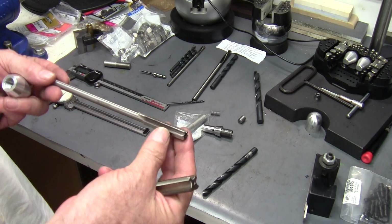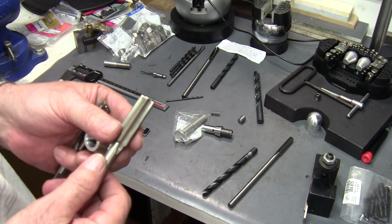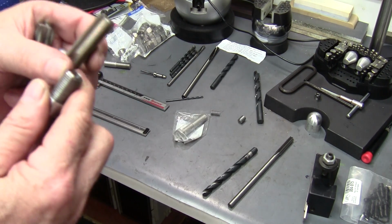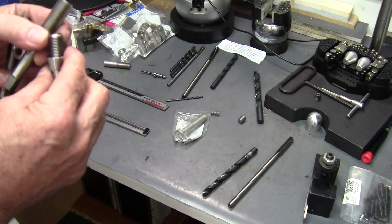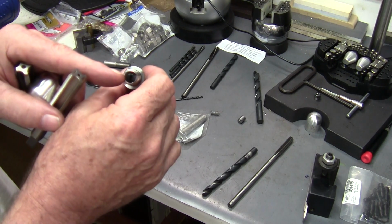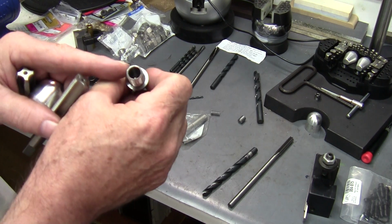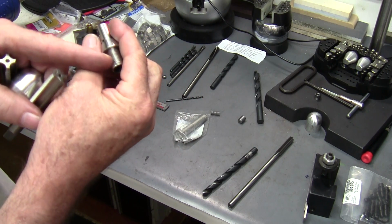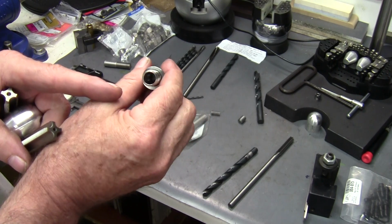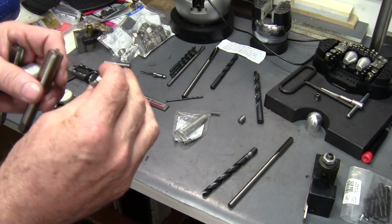you're not going to be able to get away with this .375 reamer. You're going to have to go to .350 because the threads on the 1/2-13 are going to be deeper. And right now, with the half 20 and a 0.375 inside diameter on the cylinder bore here, there's probably a 20 thousandths wall thickness left between the bottom of the threads and the inside of the wall. So it's not a lot, but it's, you know, it's substantial.